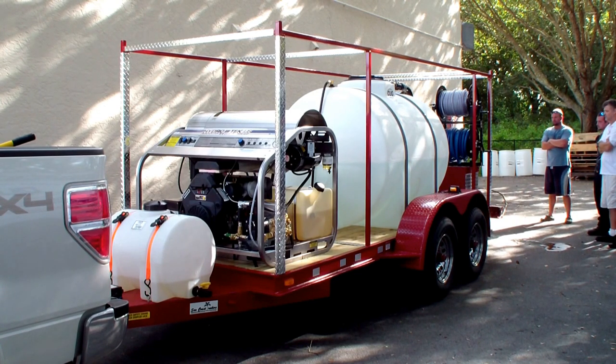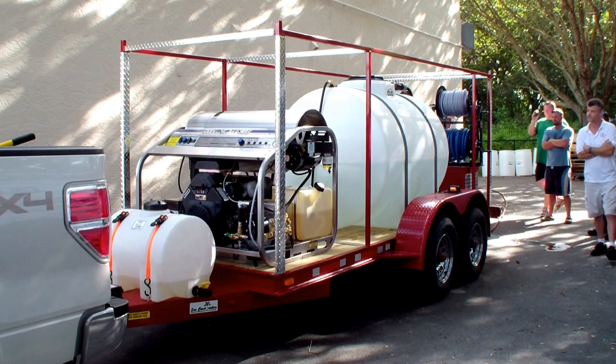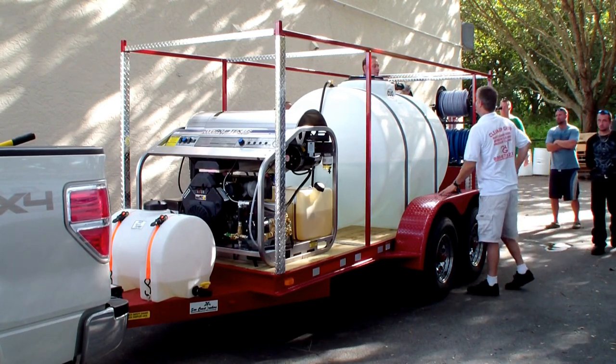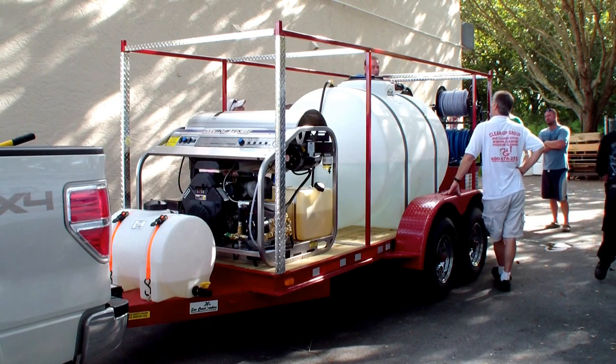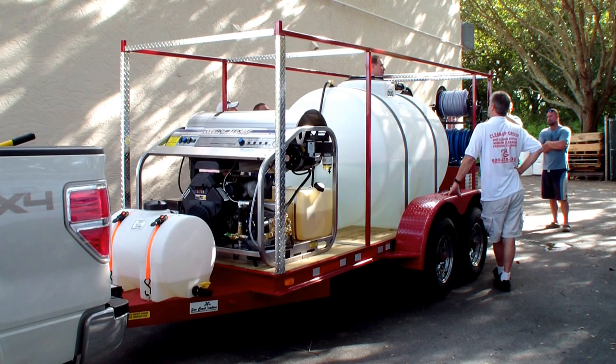Fire hydrant water is actually pretty rough with a bunch of debris. You actually have a filter housing here — you just basically pull that off to check your filter. You can unscrew it. You can flush out the hydrant before you pull water. If you have to use lake water or other sources, that's a possibility — it's not the greatest, but at least you've got some pre-filtration going on here.